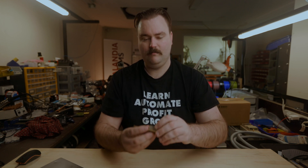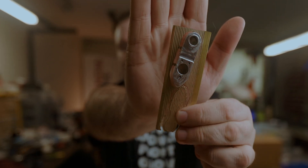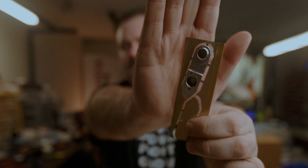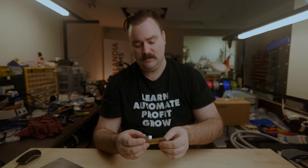We've got five tabs on the part itself — I misplaced this one when I put it in the vise so the top one's missing, but if you turn it around you'll see there are four tabs holding the stock in. I just clipped those off with a side cutter, then filed them and used a little bit of sandpaper to gently bring them back into tolerance, and it looks really, really good. I've got some parts in the tumbler — let me come back.